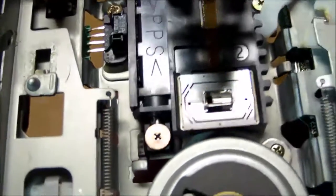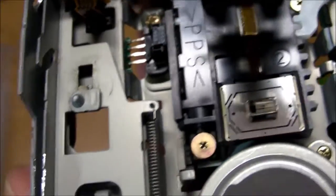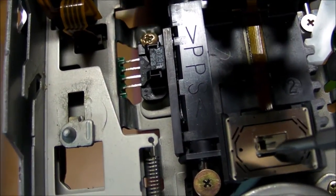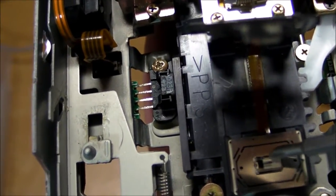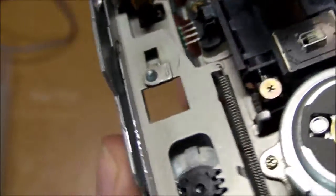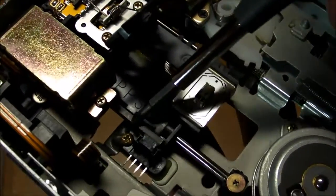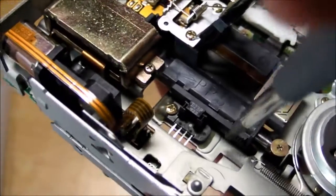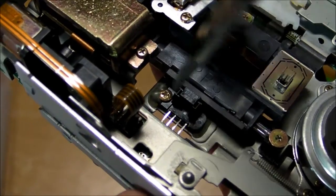Same thing on the bottom piece down here too. That darker one you see right in the middle is actually a groove in the material. But that's a head and that's a head — the whole thing is a head, but those are two different ferrite cores. Here's another little sensor mechanism. Looks like a Hall effect sensor on some kind of magnetic material here. It's not attracting the steel screwdriver at all — it doesn't seem to be a permanent magnet. I have no idea what the heck this thing is doing here.